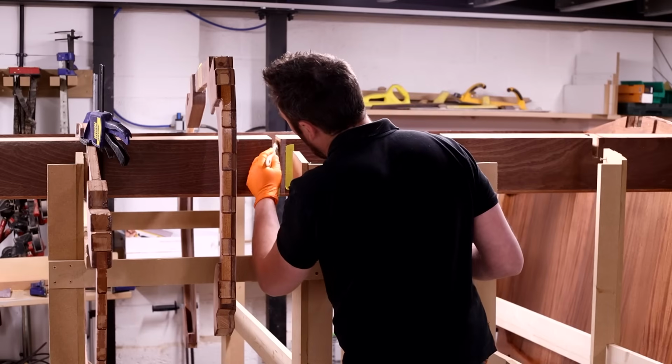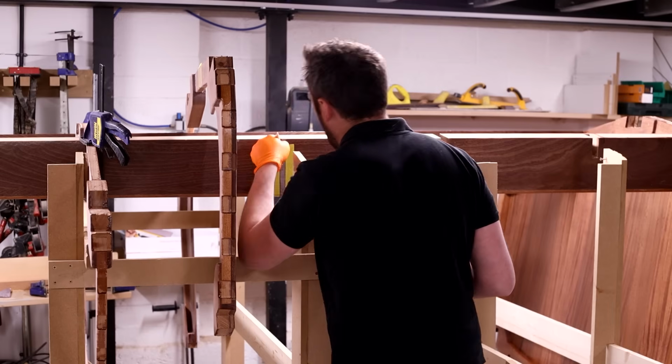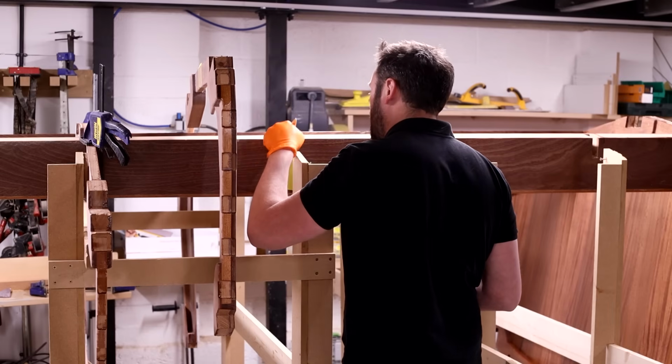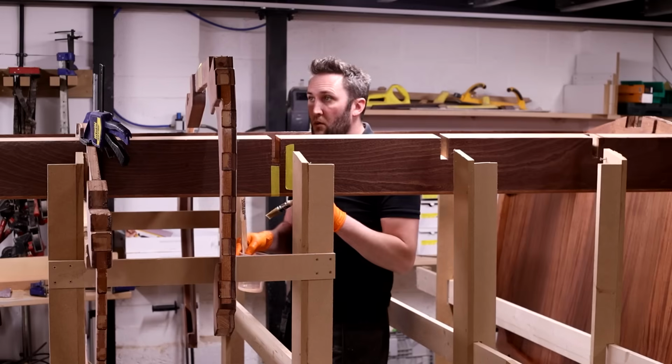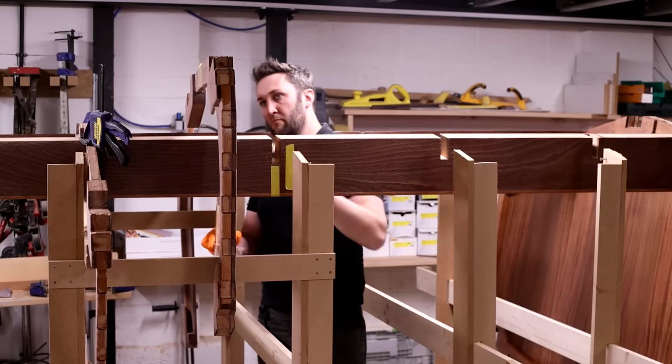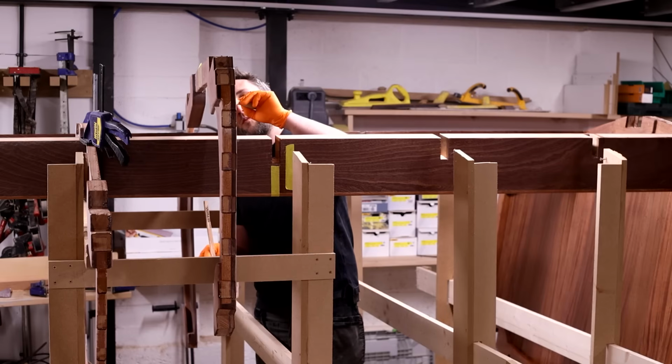So I'll make sure that I've got that frame down to the correct height and I'm happy with the notch. I then marked up everything that needs to be abraded, and you can see I'm just using the tape here really more than anything else, just to tell myself where the sections need to be abraded and where the glue needs to be applied, because we've got the edges of the bulkheads bonding to the stringers here as well as the notch within the frame.